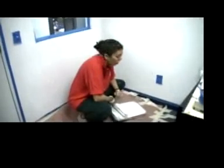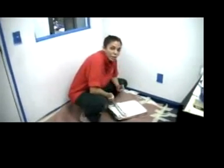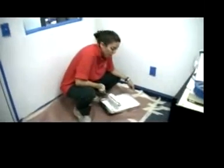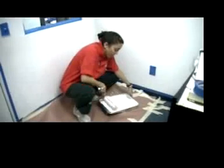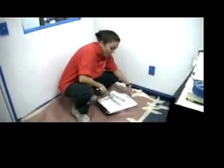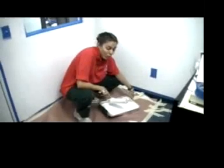Now, Leah showed you what to do with the brush around the trim. I'm going to show you how to use the paint roller. As you can see in the paint pan, most of the paint is towards the bottom. When you put your roller on the pan, you want to move it in a downward direction to make sure you get the entire roller covered with paint. But make sure there's not too much paint on your roller, or you'll get it everywhere, which defeats the purpose.